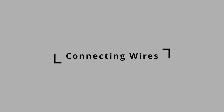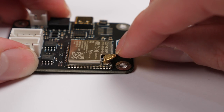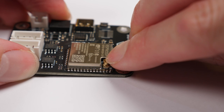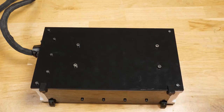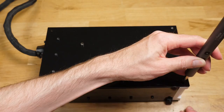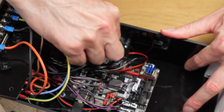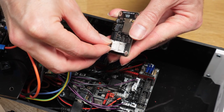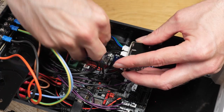As it can be difficult to do later, first attach the antenna to the ESP32 module on the analyser. It's a very small connector and can be damaged, so be sure to align it carefully before pressing it down. Next, get the analyser connected in line with the stepper motor. It's designed to attach at the control board side, so turn off your printer and open any enclosure to get access to the control board. Unplug the stepper motor you want to analyse and connect it to one of the plugs on the analyser — it doesn't matter which one. Then connect the other plug on the analyser to the control board, back where the stepper motor was connected.